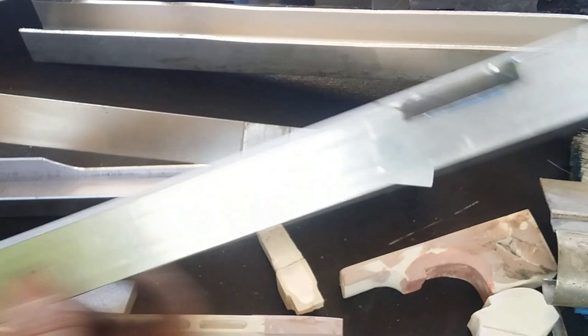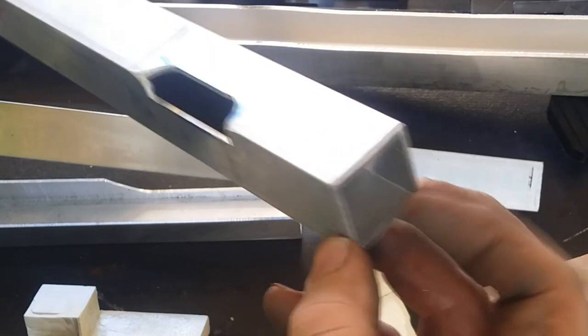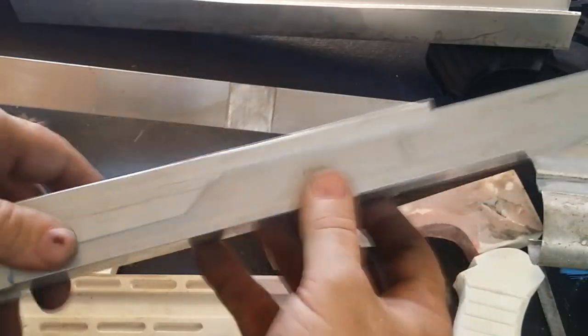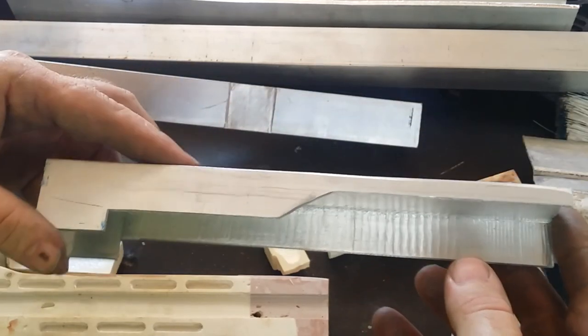The piece that I've done here is just a test to see what it would come out like. The wall thickness of this is a little bit too thin — this is about 1.6mm. I'm going up to something that's about 3mm thick by comparison, but the outside diameter remains the same, which is why I've been able to start working on that other piece.